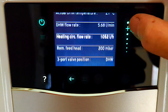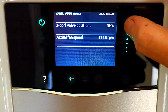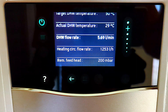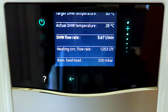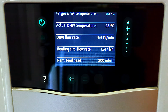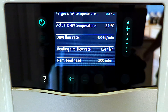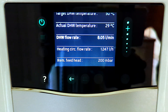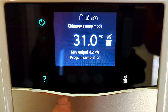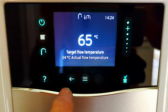If I scroll down to three port valve position you can see it's in heating right now but it's going to change to hot water - and there we go, hot water. So we now know that the valve is in the hot water position, or it certainly should be. I hope you agree this is a really useful little menu. I was then thinking it'd be really useful if you could find this somewhere else on the boiler without having to be in chimney sweep mode. Let's back out of chimney sweep mode.